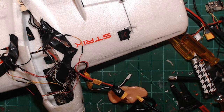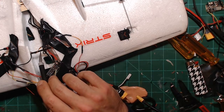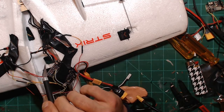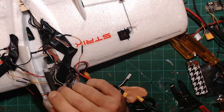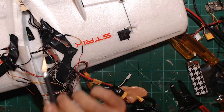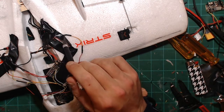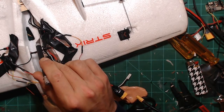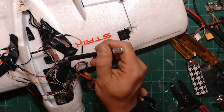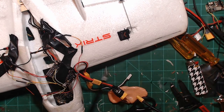Alright, here is kind of where the rubber meets the road. This is where everything gets a little complicated because this spar gets in the way. This is what's really great about having a kit versus plug and play, because you can do all this work and then spar it all up later. But that's not an option here, so I have wires taped up and held out of place everywhere. Right here is my ESC and I've just soldered the ESC wires to the two rear pads right there.